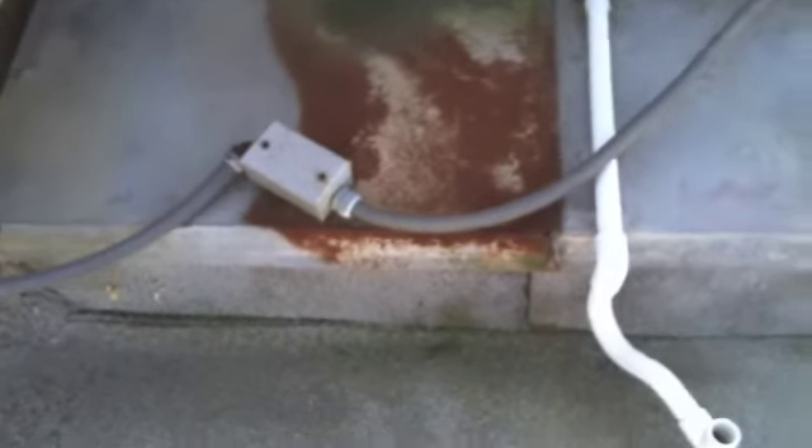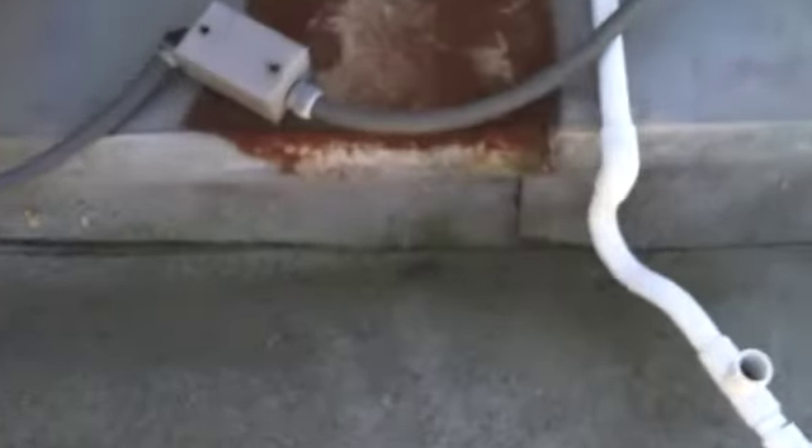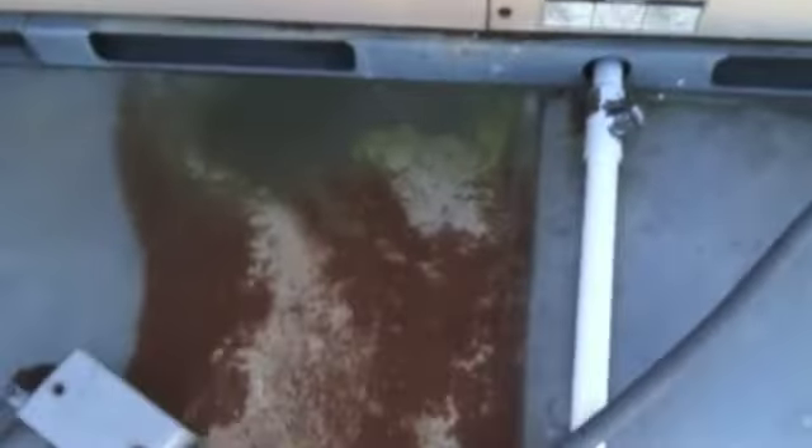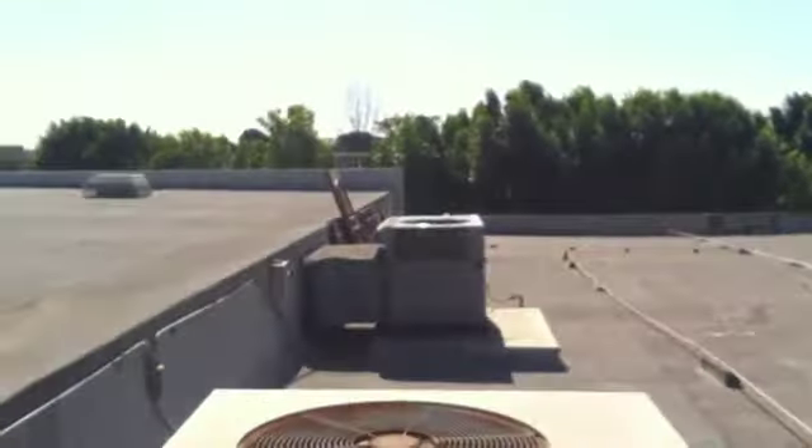As an option, we may want to consider — you can see the rust here on this HVAC pan. We've got a seam on this metal platform, just big enough where it needed to be seamed, so it's possible the water is getting underneath here. As an option, we may want to consider lifting this unit and putting a new pan down if, in fact, there's a leak here. Otherwise, all we can really do is seal it, which would be a temporary fix. The same goes for that one over there.